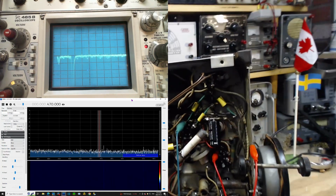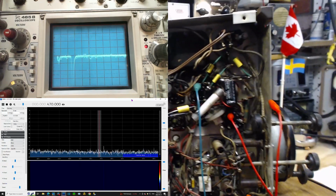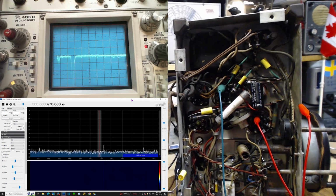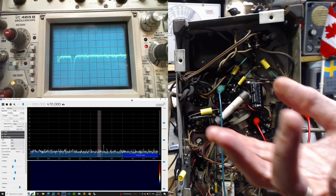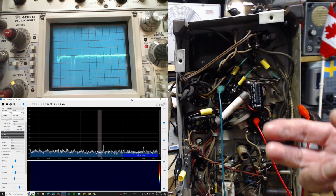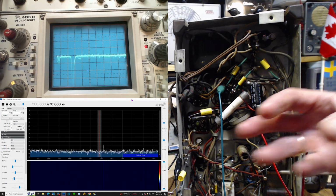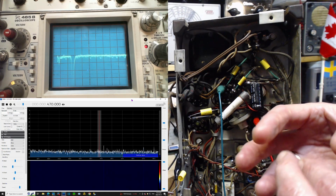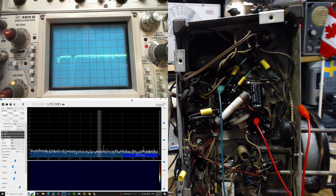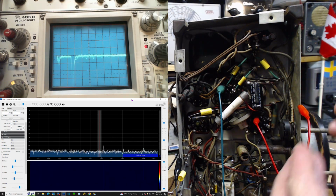The metal shell of the tube is a problem. Unless you do something, that metal shell is just sitting in the radio like an antenna, picking up radiations that are coming from the radio and from anywhere else, really. And because it's a metal tube right around the works that are inside, whatever's happening in the metal tube is going to cause an effect inside. So you basically have an antenna hooked up accidentally to that tube.